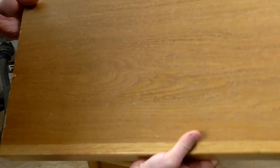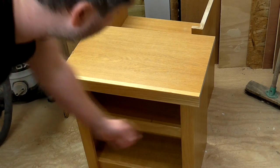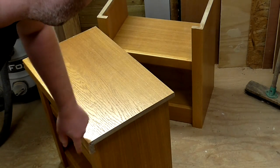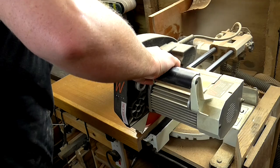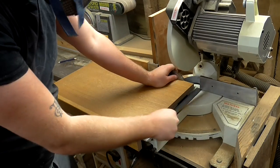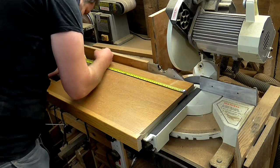Now I just need to add the top. I kept the best pieces aside and I need to cut these to the right width for the unit. Then finally I just need to add some oak trim to the side here to hide the MDF edges. I made a cut most of the way through the top panels but left the trim protruding by about three millimetres on each end, which would be the thickness of my trim for the edges.